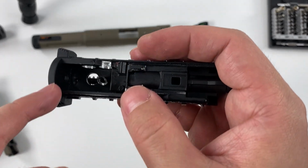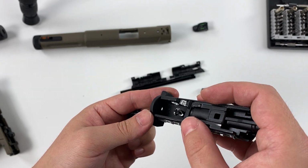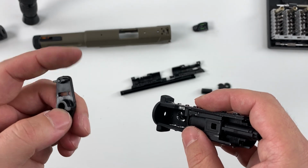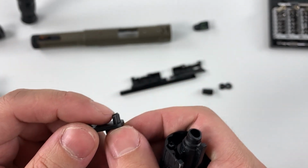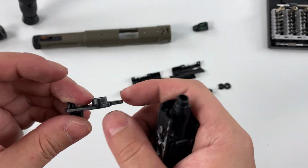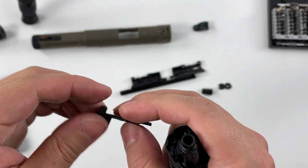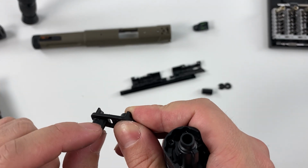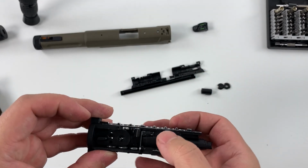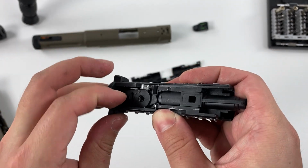However, on the other side, you can see there are two dents in there. Yeah, hard to get some light in here. Yeah, right there. So that's the click thing, the sound you get. And that actually matches this knob here, which I already cut off like halfway to make it click less. There is no spring or anything, it just counts on the flexibility of the plastic, which is kind of flexible. That's why I even have the cutout to make this more flexible. However, this is the part that you push, and when you push it, part of the force goes downwards inevitably. So that makes it actually, I'm not even putting a screw there, and I can already feel the resistance of moving this.